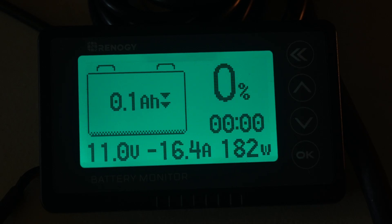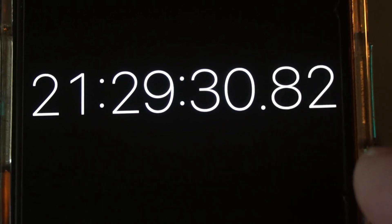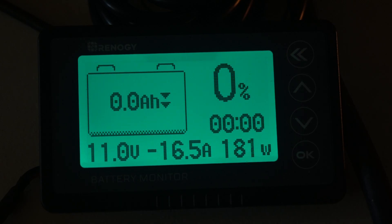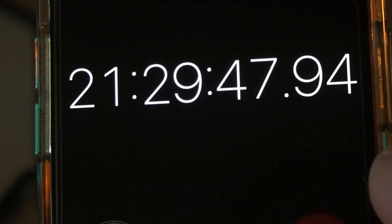The shunt now says zero minutes — and it's still running. We're at 11 volts. True to form, these lithium batteries hold their voltage — it held 13.1 volts for a long time, starting at 13.4. We're now almost at 22 hours. Even though it's still going, I'll stop the count here at 22 hours for a clean number.